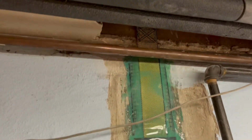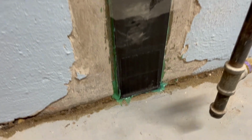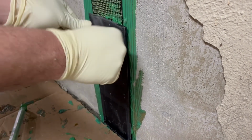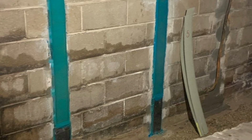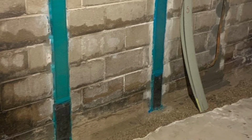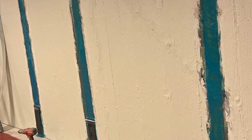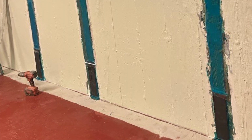Your bottom plate will now hook this and your carbon fiber into the footing of your foundation. This will allow the carbon fiber to have a good strong anchor point so that when that wall tries to move, it is now anchored at the bottom, at the top, and it has tensile strength all the way down the wall, so the wall will not have the ability to move. In fact, it ties the entire wall together by making the 5 components of your wall one piece.